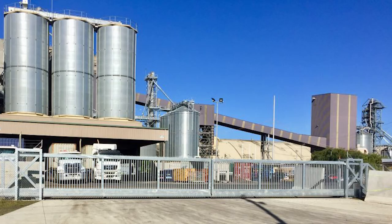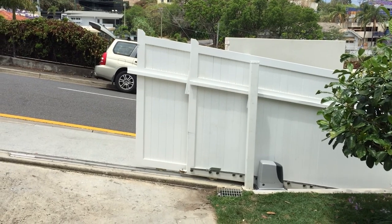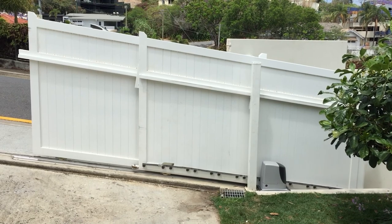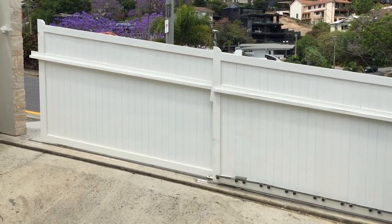For really large gates and gates on really steep slopes across the driveway, three-phase AC motors with variable-speed inverter drives are better because their speed can be varied with no loss of torque. For gates up to two-and-a-half metric tons, these motors can be powered from single-phase 240-volt AC mains because the inverter converts this to three-phase AC at whatever frequency is needed. The speed of the motor is determined by this frequency — starting low for a slow, full-torque start, then increasing to accelerate the gate to a higher speed, before slowing right down to a soft stop.